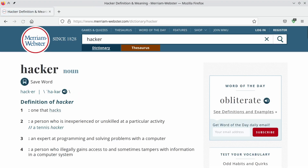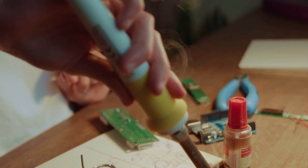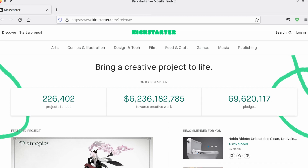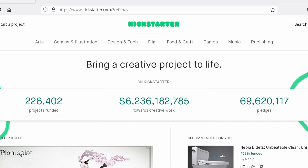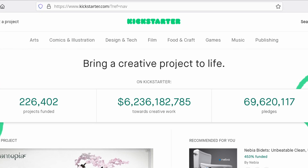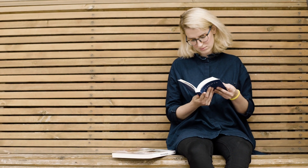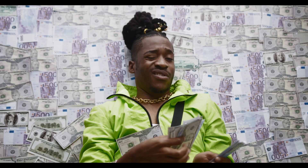Here's the problem: such a layout is not easy to design. Any layout with DDR3 memory requires a large number of traces with very strict constraints about how they're laid out. This is something best done by a professional, and that costs money. So the obvious answer is to open a Kickstarter campaign or some other form of mass financing. While that's certainly an option, I'll only go that route once I'm ready to deliver — I don't want to raise money and have people wait a long time for boards, or get boards and then wait for them to become usable. I only want to take your money once I've convinced myself I can deliver.